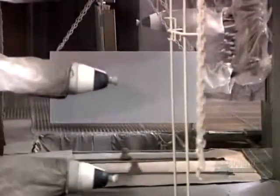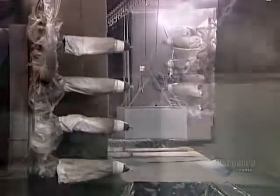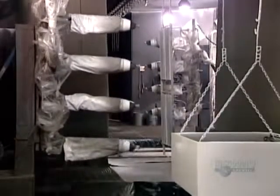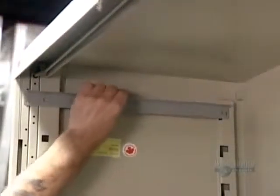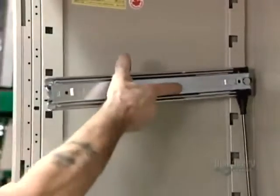In the paint department, rotary atomizers envelop the filing cabinets in a mist of paint containing a synthetic resin for durability. The atomizers lace the paint particles with a negative electric charge, which draws the particles to a positive charge on the cabinets, creating a thorough and even coat. After 20 minutes in an oven to bake the paint, assembly can begin.